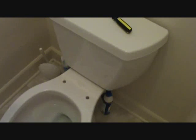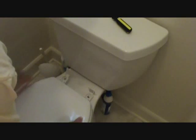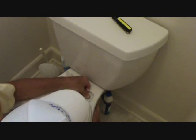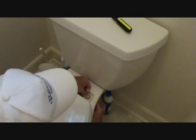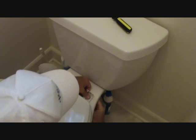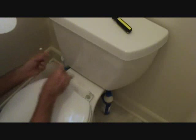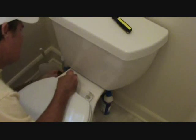Simple Simon. Just put this other one back up here, line it up, and it comes with the same little plastic inserts, the screws, and the ends that fit underneath. Just push it down in there, put the old one in that box, reach underneath here. I'm going to start it with my hand as far as I can go. This one's not hitting the side of the toilet, so I can just hold onto it and spin it on there. Tighten it from the top — I can do this one the same way.